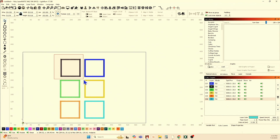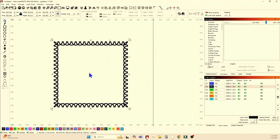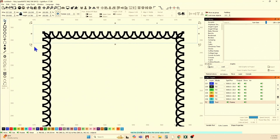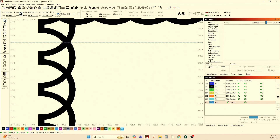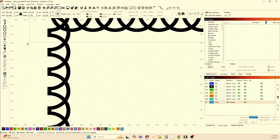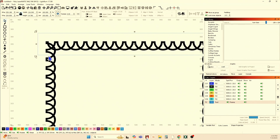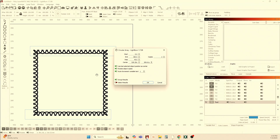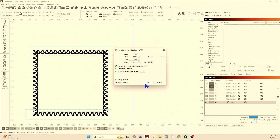I've got this original frame. I'm going to duplicate that and bring it over here. Now I want to segment this. It is crucial that this is all grouped — it's one object. What I want to do is select a toolpath and create a rectangle that's going to start outside the perimeter of that frame. I'll come in tight and grab that frame and put it right there on that intersection point, only because that's where I want to break this particular frame. You line that up where you want to break it. Then hold Shift, select the frame, use your circular array tool, do two copies, and group the results. That's going to put two pieces opposite each other, and they are grouped.